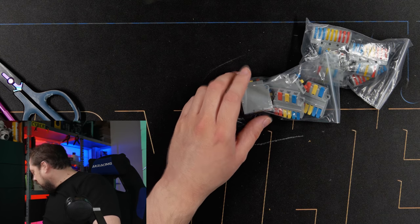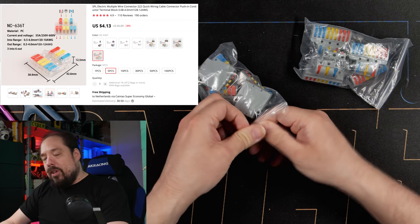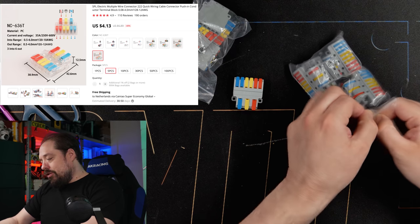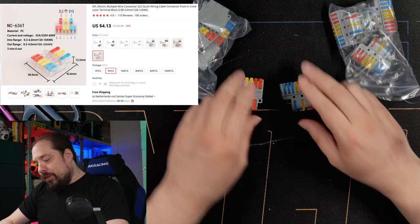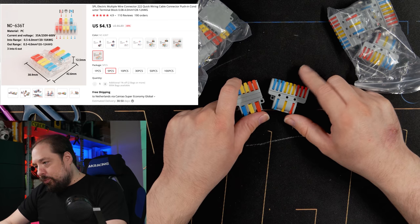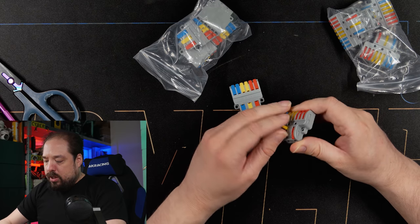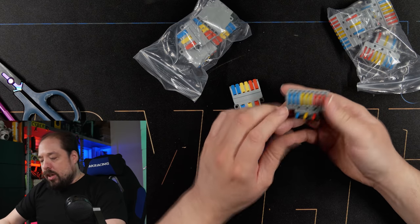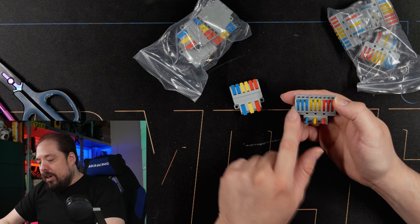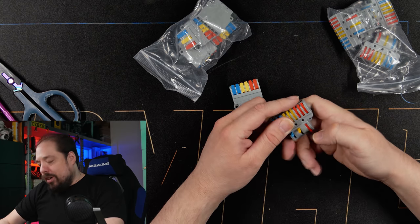Staying with LED content, during testing, especially if you have like a Dig Uno, you can quickly run out of ports. So I ordered some of these, let's call them multiplication terminals. So one wire goes in and then gets split to two, or in this case to three. So you could put in negative, data, and a plus, and then actually run it to three different strips. Or even if you're just using a single strip, you can put in data here, and then you have three injection wires for minus and plus